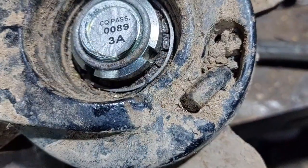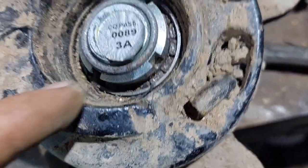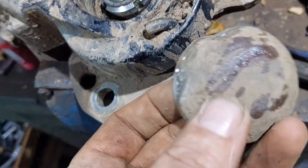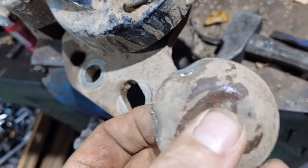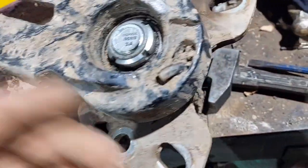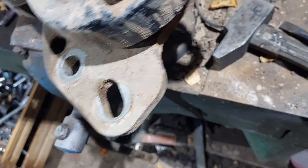So getting here, these bearings actually don't seem too bad, but they're cheap to do, so top bearings don't usually get a lot of grief. It's usually the bottom bearings that take the hammer because of them being in all the wet and the crap. But one modification I'm considering doing is drilling a hole in the end there and putting a grease nipple in, so I can periodically grease them. That will hopefully push the crap out of them and keep them clean a bit.